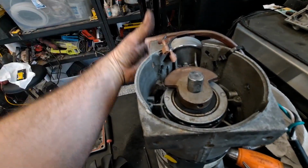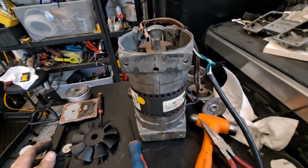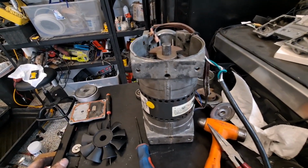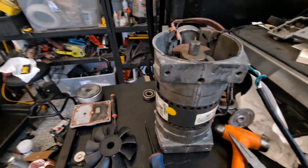then you'll access that bolt. And that's assuming you got the head off. You access that bolt, pull that apart, and then you can catch up on the main shaft bearings or whatever. Maybe you're just doing the eccentric bearings. But hopefully that does help somebody.